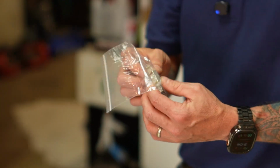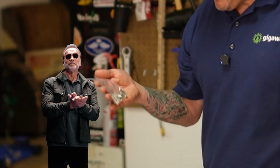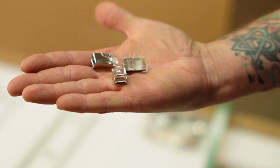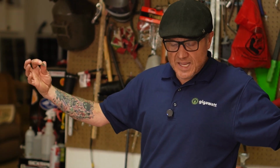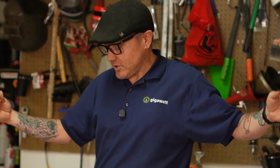There's 4 of these. They're Ethernet terminators. So is this where we have like Arnold Schwarzenegger like Terminator 2. Yeah. Come on screen. These are your Terminators. They'll be back. It's used to begin and end a communication network where if you've got more than one in primary, secondary orientation, you would have one on either end of the network, and the resistor in the Terminator allows it to say, okay, I can see the beginning and the end of the communication network.